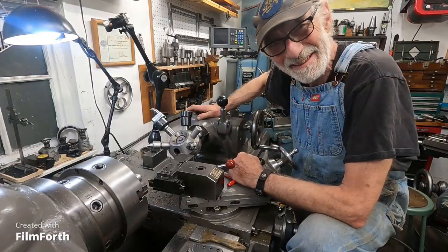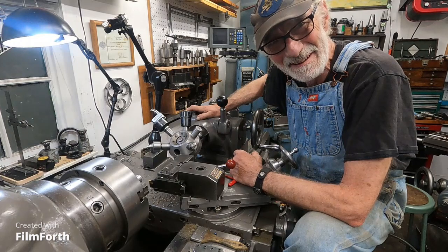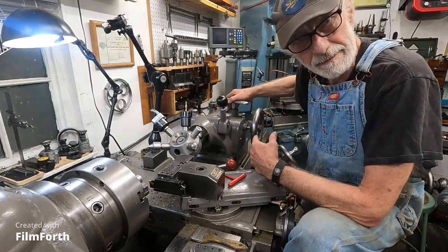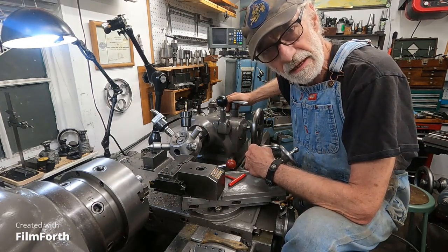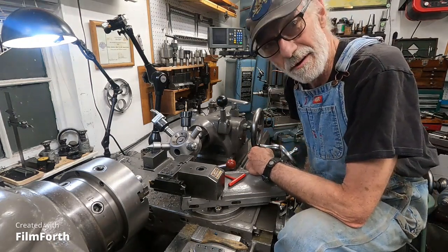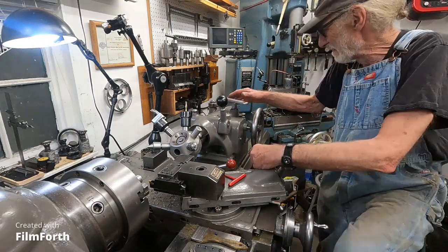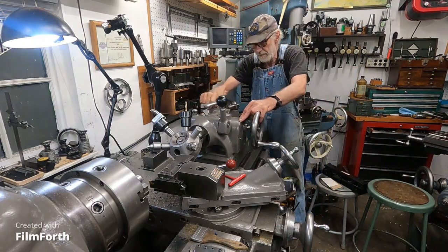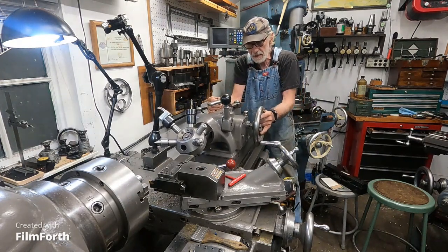Do some machining. What we have here is an early baby Axelson lathe. Now, what's kind of funny about this is the tailstock is really quite heavy on these. And during this year, 1941, when this was made, a crank to move this monster tailstock along the ways was optional. And of course, this machine doesn't have the crank. So to move this tailstock, I have to get behind here, loosen these nuts, make sure they're loose, and pull it. And push it. But once you get it going, it does okay.